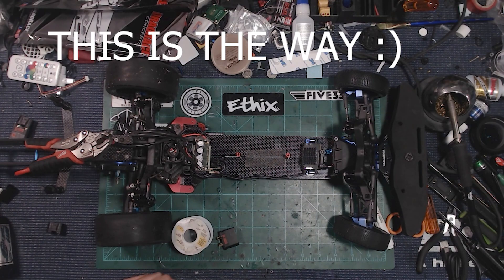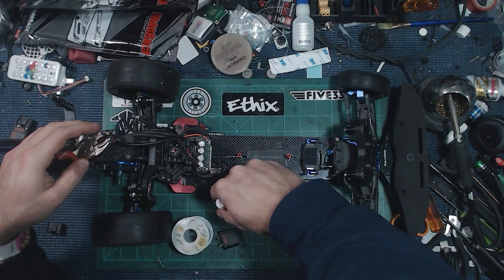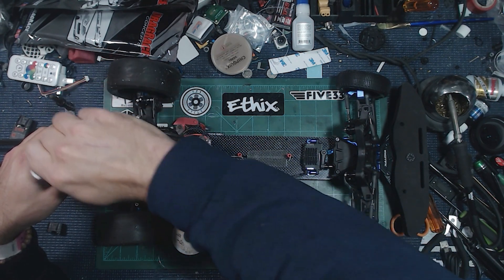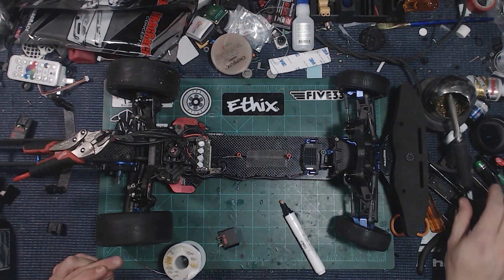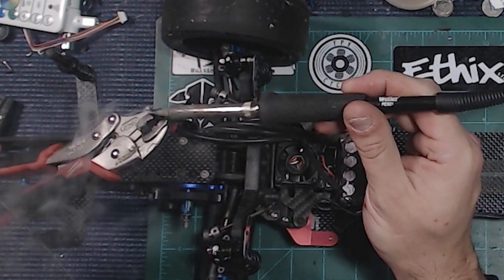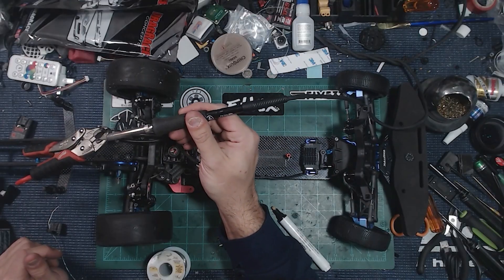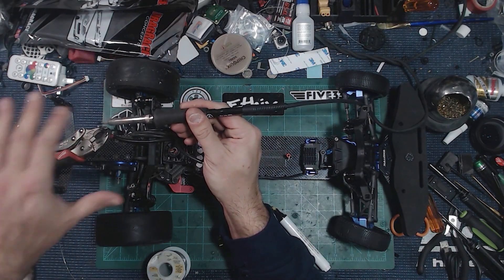For this one we've got it all tightened up in the helping hand pliers. I take the flux pen and dab some flux onto the wire. This should go a lot smoother. Apply some heat to the wire — you can see the flux already burning — then bring in the solder and it just flows right in. I like to start on one side, get some heat going, then move to the other side and watch everything flow all the way through the wire.